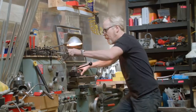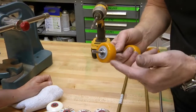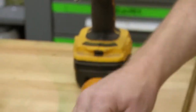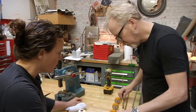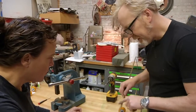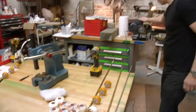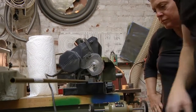What they've got here is they've actually machined a little notch into the axle, which is ridiculous because it makes it even weaker. And then they've put a little circlip on there. So instead of doing that, I'm just going to use a little brass spacer that threads over. What we need are six pieces of brass cut to exactly that thickness and width. I've got this little saw with a clamp. We need six of those.